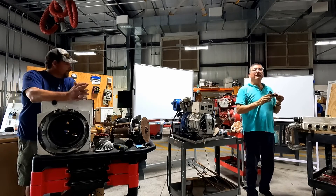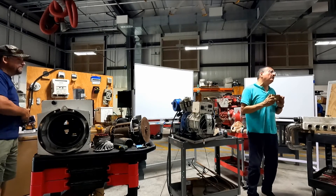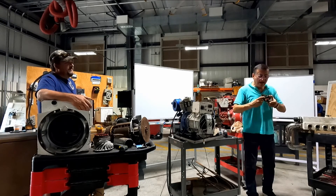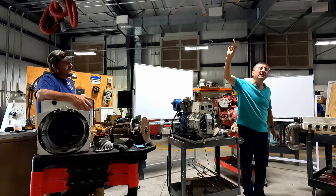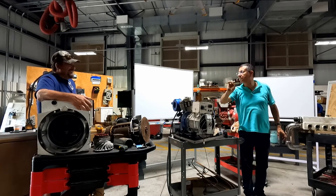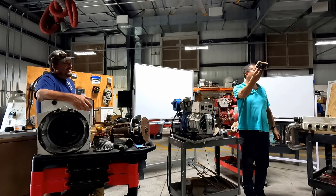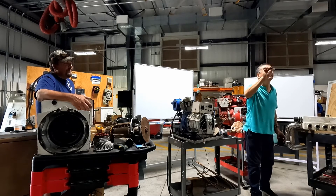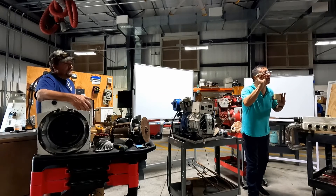A customer called me and said the readings were 80 and 60 volts. I told him don't touch that button - it will explode the capacitor, and this element is $1,500. He exploded the capacitor anyway. If the difference is more than 10%, don't touch the pot - it is a problem on the back end, not a small calibration issue.